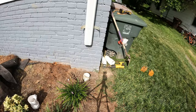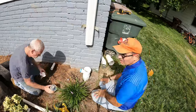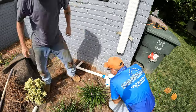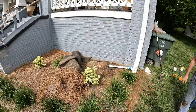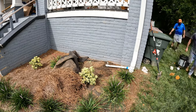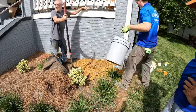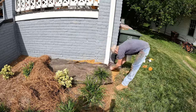With as much fall as we had to the front sidewalk, we could have done a gravity drain, but that would have been a little more expensive and much more disruptive to the front yard — and she's already got the front yard really nicely fixed up. So we decided to do the sump pump and drop it into our existing drainage pipe, which is what we're working on: getting the pipe from the sump pump into the existing drainage pipe.